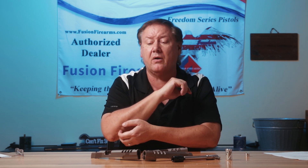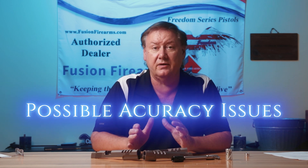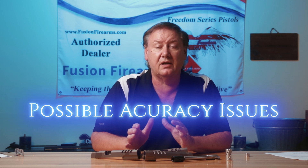You're not looking for as much accuracy with a shotgun as you are pinpoint accuracy with a pistol, revolver, or rifle. One thing you have is a shave point: if you ever see a rifle or pistol that is actually ported in the barrel, you'll see all types of shaved lead and copper in that area. What is that doing to the geometry of your bullet? As the porting shaves copper, brass, or lead off one side of the bullet, the bullet becomes unbalanced — concentricity is out slightly — and the weight is off on one side, giving you less accuracy.